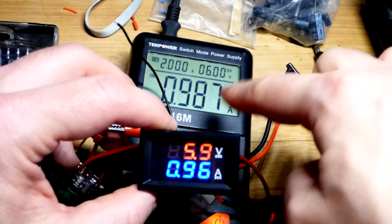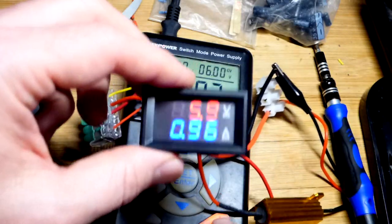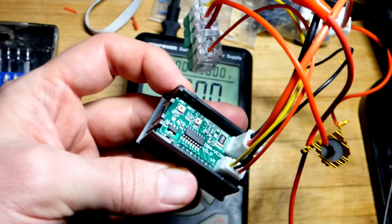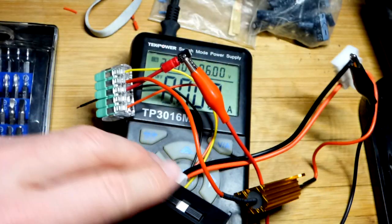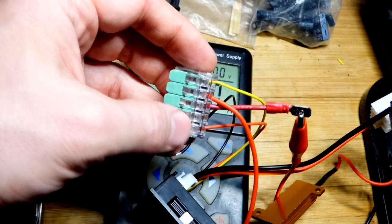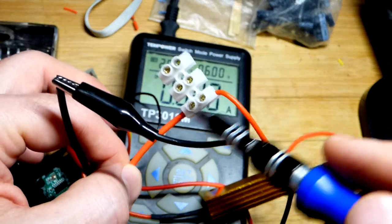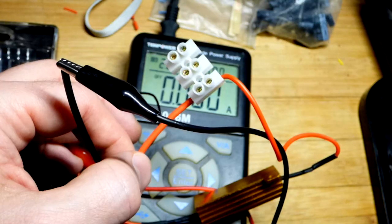This voltage reading is probably pretty accurate. Remember, that current also includes the current for lighting the LEDs, whereas this current measurement does not. I'll turn the power supply off — the resistor is really hot. Because the current was off a little bit, there's a trim pot right there and I just turned it until we got to the correct setting. Hopefully this will be really accurate from now on. I think this is how I'm going to wire it up. In the previous video I did a bus bar where you screw down onto the wires and I added ferrules, but I think this five-way connector is a much better way. I should have added ferrules to this inline as well — the screws twist the wire a bit, but as long as you only do it occasionally it's not too bad. Thanks for watching — see you in the next one.